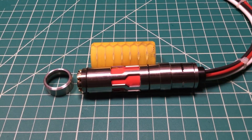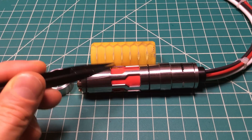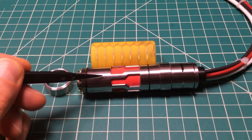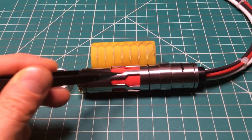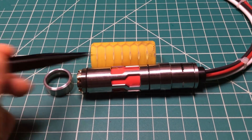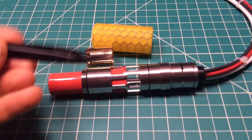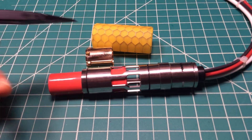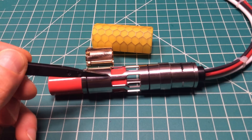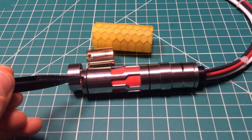Here's the mod without tape and without thermal imaging. We've got these aesthetic cutouts — cost extra money, not sure why they did that, you can see them through the sleeve. We saw some of the heating right at these points where current flowing up through the mod enters this choke point. This is naturally higher resistance — less metal — so we can localize heating here. Also, the cup, which is the button that the battery sits in, ends about here. If this cup is not sitting perfectly centered but is tilted one way or the other, just this little edge might be what's touching, maybe at the bottom and then up along here somewhere. That can concentrate the current and cause additional heating. Certainly the threads can be a point where there's heating too, and we saw some of that.